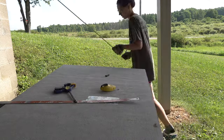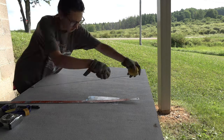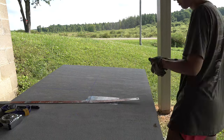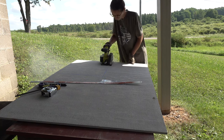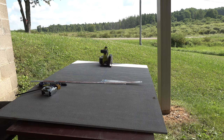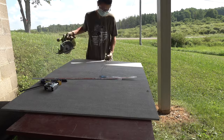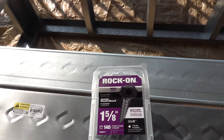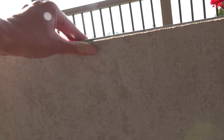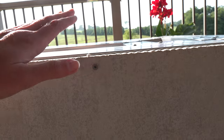I have gone ahead and cut most of my Wonder Board pieces out and started to attach those, as you can see right here. I'm going to apply the thinset directly to the Wonder Board that we got at Home Depot. I just measured my dimensions out, used a chalk line to make my lines, and then used a circular saw to cut it. Make sure you're wearing safety glasses, as it's super dusty. These screws here attach the Wonder Board, and I'm not having any trouble getting it to sink into the metal.